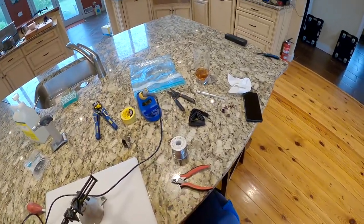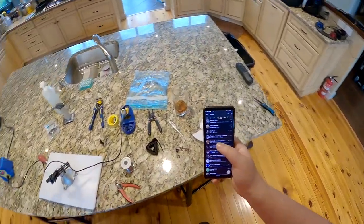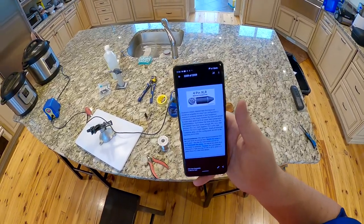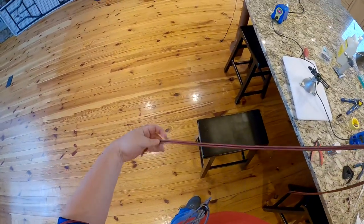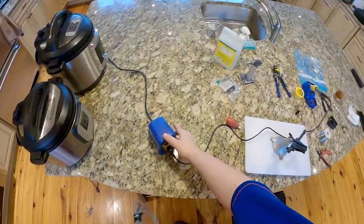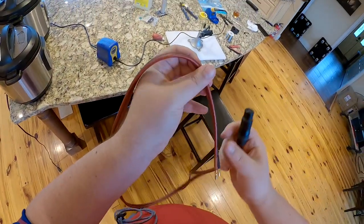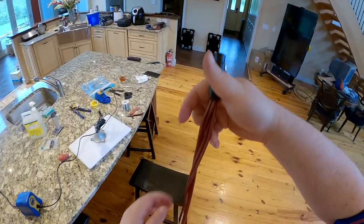Totally didn't remember which one is which — however, the wires are so thick there's no chance for them to rotate, so this is pin one and two which was left plus and minus. Looking at the XLR diagram: pin one is left plus and pin two is left minus — which makes this our left lead and the other one our right lead. Shutting everything off. This is left. We'll be able to test that with Foobar and just do left-right. Do I want to braid it? Let me check which one is marked — the right one is actually marked. I didn't even intend to do that, so there's R and there's L.